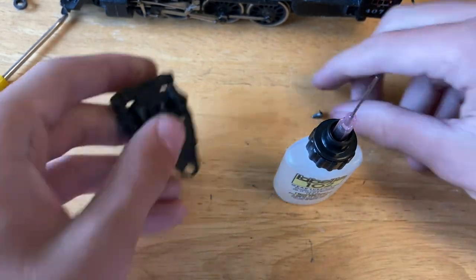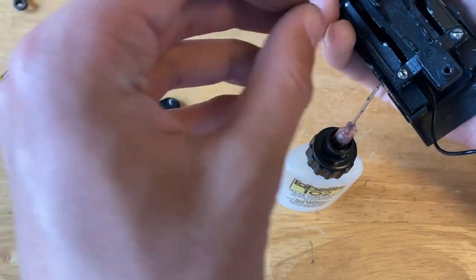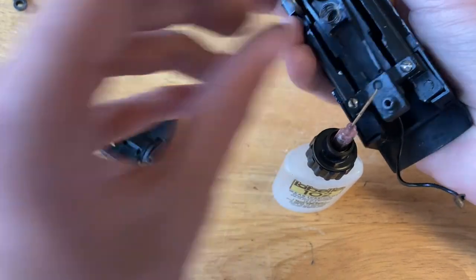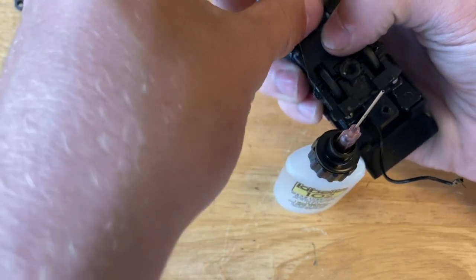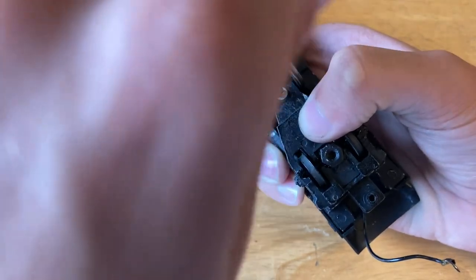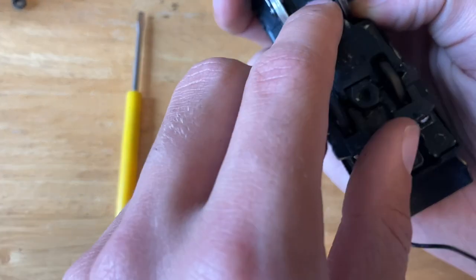I have this screw and this spring — I think this goes on the other way. One side is slightly larger than the other, so the short end is closest to the driving wheels. It's actually a nice feature on this older engine to have sprung leading wheels. It's a little tight inside there but sprung rear wheels here as well. Just need a little bit of oil on the inside and the outside — and there you go, pretty quiet which is nice. The spring keys in and down, spring is still in there nice and sprung and that's all tightened.